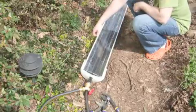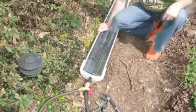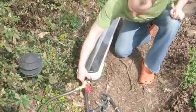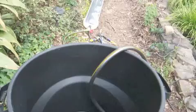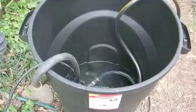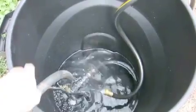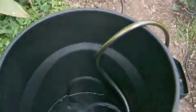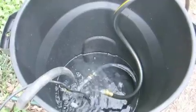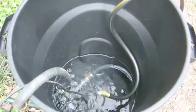I've put the mirrored reflective backing inside the pipe, and this is an acrylic sheet with a curtain that's just screwed in place so that no leaves and debris get in there. You'll see I've got a hose pipe connected with a hose clamp and a valve here. At the bottom of this pail there is a pump connected to the hose piping which takes the water to the solar concentrating trough and back again into the same container. We've got six gallons of water in here.